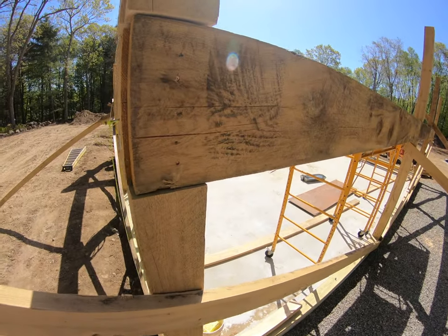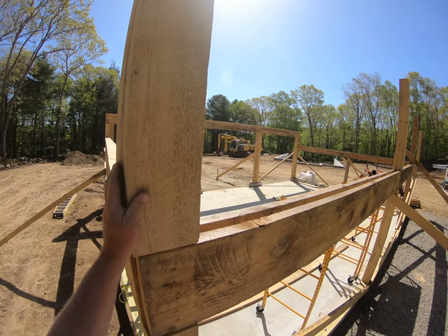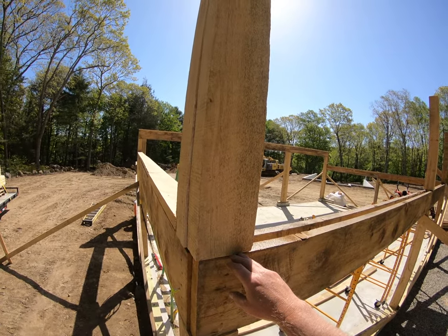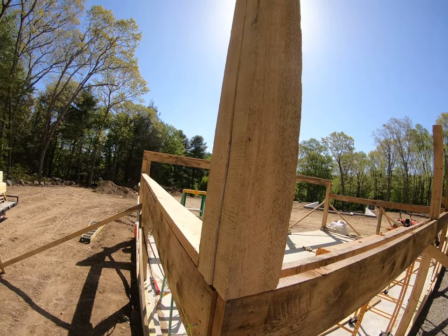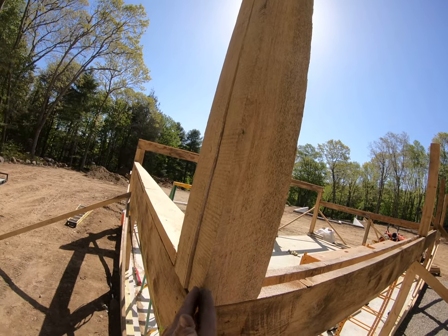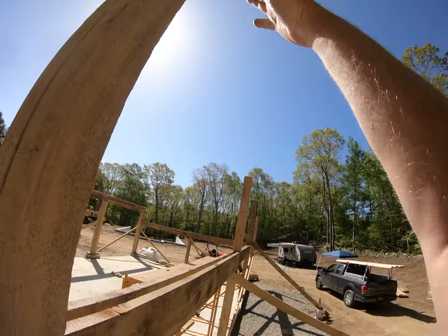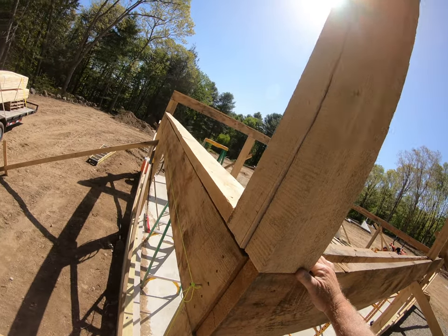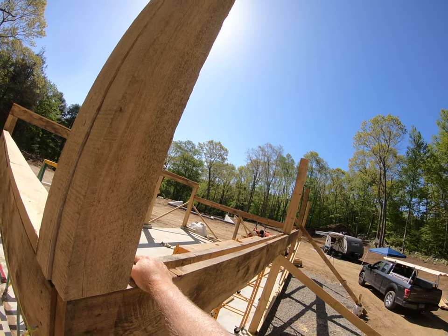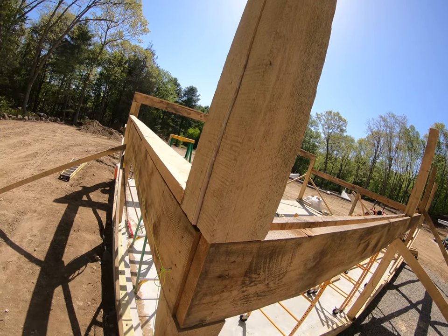And then this area up in here has been an area of contention. As you know, this right here was the original top of the building. And actually this 2x6 came and was mitered here in the corner, and then another one would come and be mitered, and that would lock that all together. Well, I wanted to raise this up for the overhang. So my suggestion was to just frame a wall on top of this 2x6. Nice 2x6 wall, and then the roof will be on top of that. But I was told that you can't do that, that you can't have a hinge.